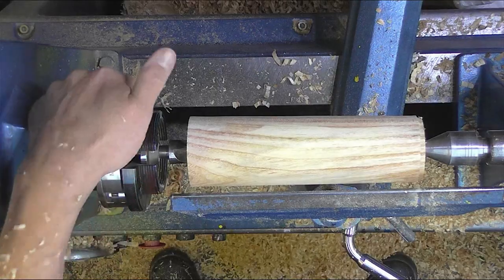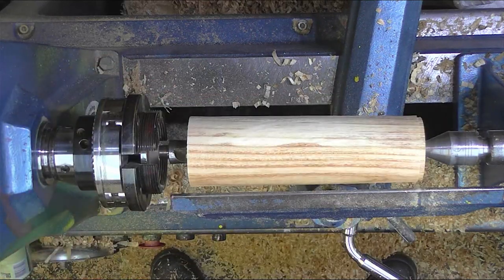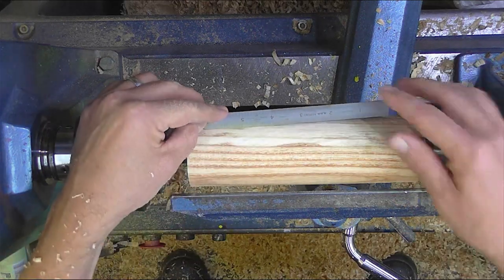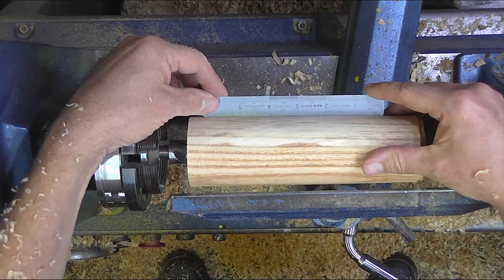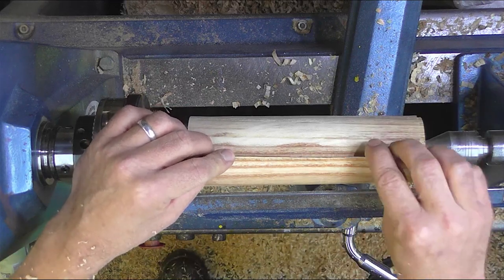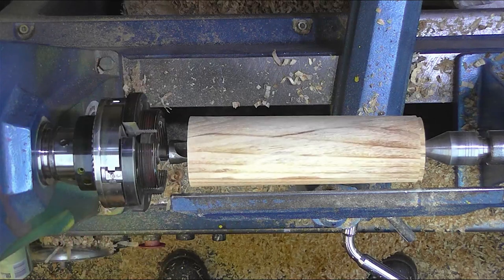Let's have a look at that — that's much nicer, cleaner, smoother all the way along. If you want to get critical of yourself, you can start putting a straight edge along it and see where you've got gaps. I'm a little bit narrower this end than up this end — maybe half a millimetre or so. But that's our introduction to the spindle roughing gouge done. Often just referred to as the roughing gouge, but please don't forget that important part of its name: it's for spindle work only. Not for bowls, not for any cross grain, not really for any branch wood with branches coming out from the side either. The weak point of this tool is the tang — if you're buying a second-hand roughing gouge and it's bent up or bent down, it's been weakened at that point, and I for one wouldn't buy one with that feature. If you've got any comments or questions, leave them below, and thanks for watching.